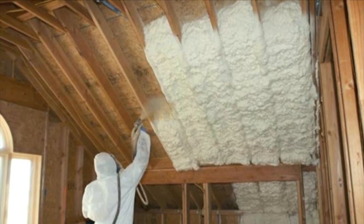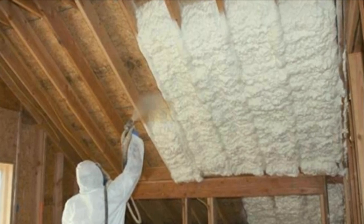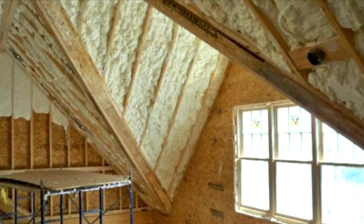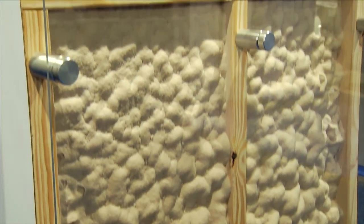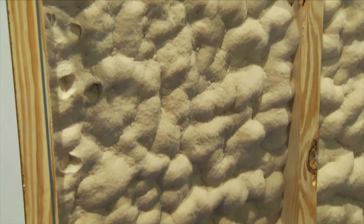When it comes to insulating unvented attics or cathedral ceilings, spray polyurethane foams offer high insulation values. CertainTeed's CertainSpray X delivers that, and something more. Not only do you get the higher R-value of traditional open cell foam, but this product has an integrated ignition barrier, meaning fire retardancy is built in—all in one step. Open cell spray foam also eliminates drafts and hot and cold spots. At two inches or more, you get an air barrier against air flow, and it's also vapor permeable, allowing moisture to move from the attic out into the environment.